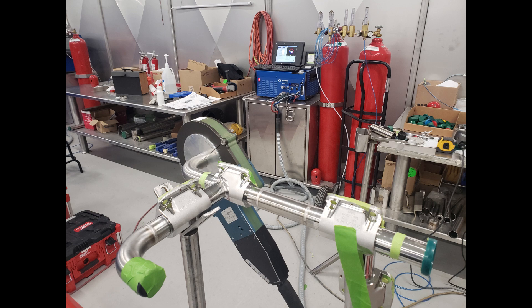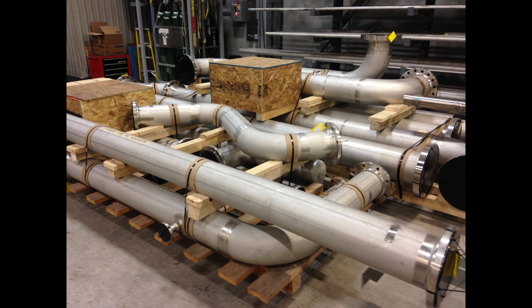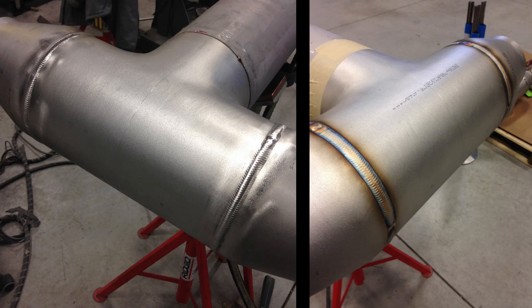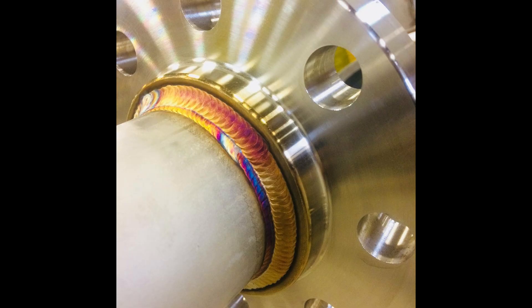The following is my experience, shared just as a reference. Stainless tubing: no significant shrink — it shrinks a little bit, but you can ignore it, so you don't have to consider shrinkage when calculating pipe cut size. Nowadays it is mostly welded by an orbital welding machine. Schedule stainless pipe such as Schedule 10 or Schedule 40: it shrinks between 3/32 and 1/8. When I do pipe welding by TIG, mostly it shrinks 3/32 per each weld joint. Socket welding: it shrinks around 1/16. Slip-on flange welding: it shrinks around 1/16 too.